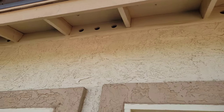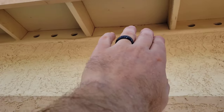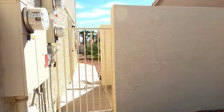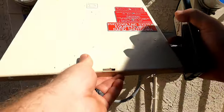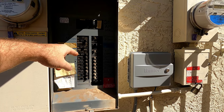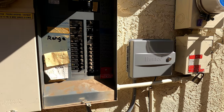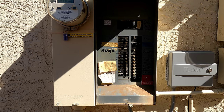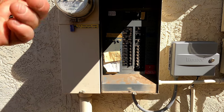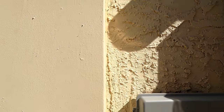These don't look too bad but this one's got a little bit of damage - you can see everything is bowed out from the moisture of the trim. Walking around the back side of the property, the latch isn't working right. The water heater is off - when a circuit breaker is off in the main service panel I can't turn it on. A home inspector doesn't have the authority to turn this on without okay from the listing agent. 200-amp service with a couple issues in the electrical panel, and this latch needs a little attention.